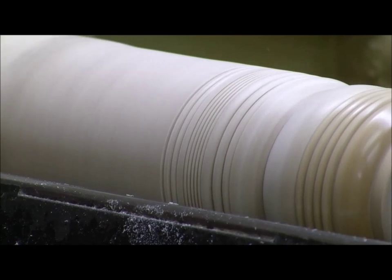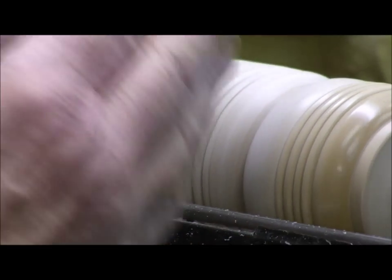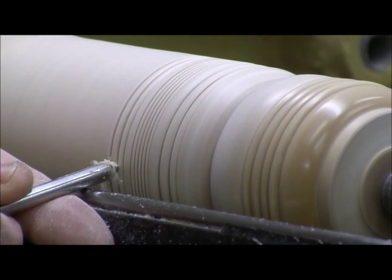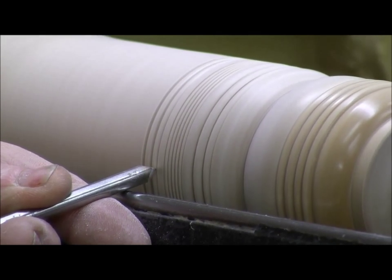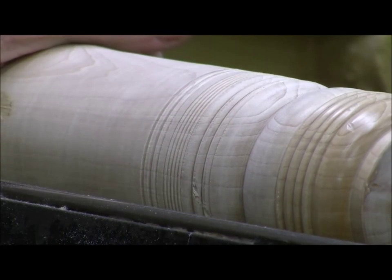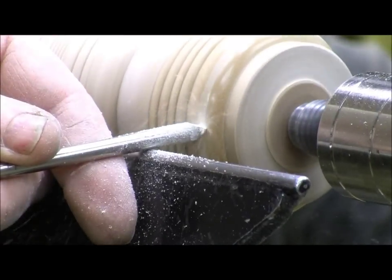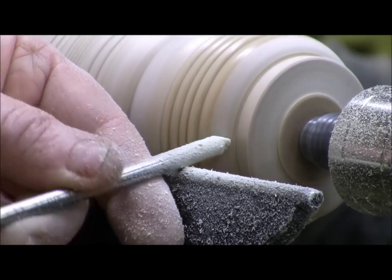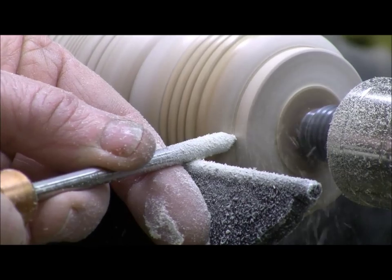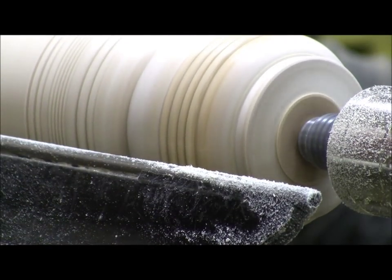You can also use it to make a really defined line between different beads. If I want to define it I just go deeper right in the middle and it makes that bead pop. Really a nice, simple tool with a lot of applications. Here I have a face — I can actually shape it with this. If you look at the angle, it's not horizontal; even by holding the tool horizontal the cutting edge is on an angle, so it's shear scraping. And then I can come here and also form my tenon — really, really user-friendly tool for doing that.